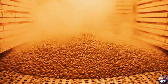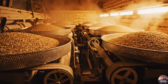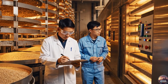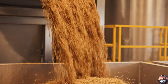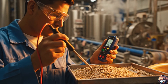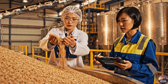The temperature is holding steady at 82 degrees Celsius. Maintaining that setting for the next hour ensures optimal drying. Moisture is at 3.4 percent — germination has stopped. The color consistency looks excellent on this batch; the golden brown hue is confirmed. A moisture test is run, and the texture and color are approved for the next stage.